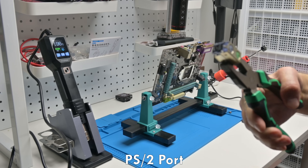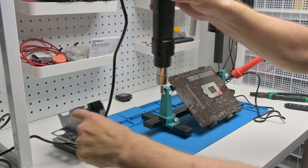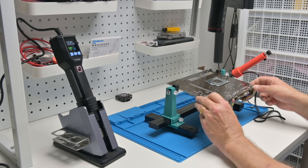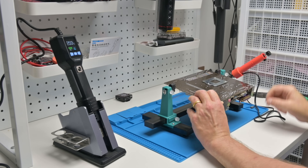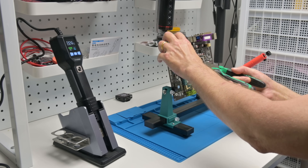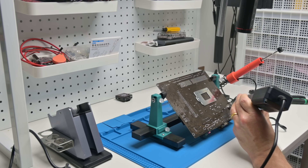With a little bit of wiggling the port comes out in one go — nothing compared to how much I had to fight last time. Sometimes the cable gets away a little bit but it's really not a big deal. I'm also looking to buy an arm to mount the heat gun so I have a free hand for soldering, since after removing components you obviously need to solder new ones in. On screen is more footage of desoldering other components, and I ended up with a nice assortment of components of different sizes.